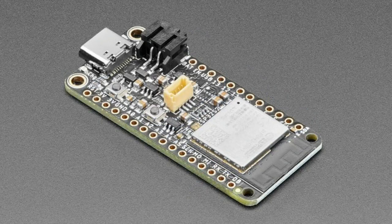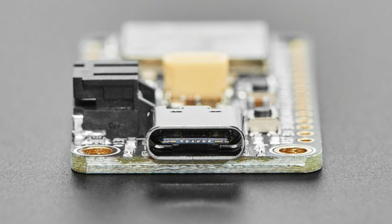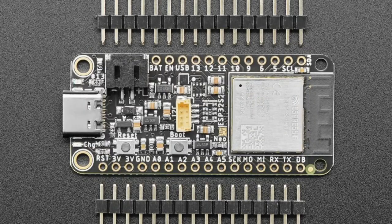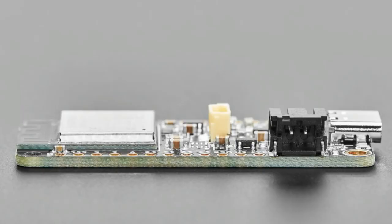Yeah, all right. Another revision. Next up, P5000, which is the ESP32-S2 Feather. This one is without the BME280 sensor on top. I released this. It was cool. I learned that I made a mistake with the low-power circuitry. I have corrected the low-power circuitry. The board is now re-released. Functionality is the same, but I now have an LDO on the STEMMA QT port. I also turn off the pull-up resistors so it doesn't have this current leakage thing. Basically, I'm getting better at doing low-power design, and this is a new revision that you can pick up.